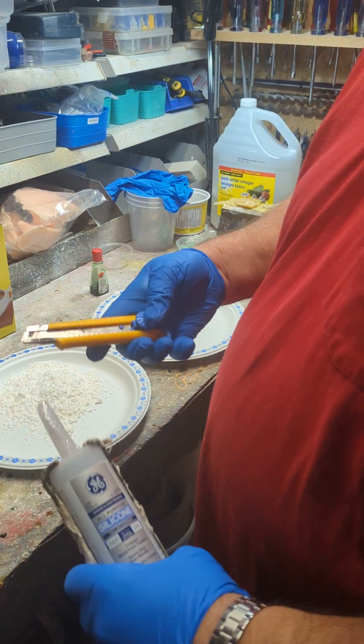I'm going to use a simple little cup and squish this down inside. It's starting to stick to my fingers, so let's get some more cornstarch on the surface. Anything on the surface with cornstarch you can clean off after it's all cured, but it doesn't stick to the latex — no special requirements for it.